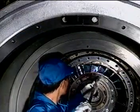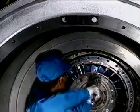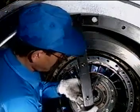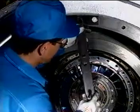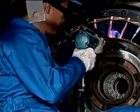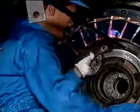Assemble the guide bar and extension bar. Screw them in an upper tapped hole. Bolt the fulcrum to the air outlet casing and suspend the notch blade from the fulcrum. Put the guide bar in a notch of the blade. Remove the remaining bolts and the segments of the intermediate ring.